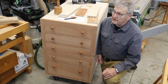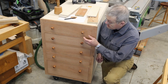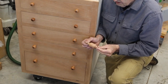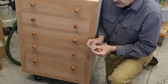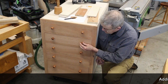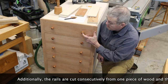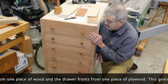Being a cabinet maker with a woodturning problem, I always try to put some turning in all of my furniture. In this piece I hand-turned the Shaker style knobs. I turn these as a joined pair like this, and then cut them in two after I've turned all of the details. Then I put them in a chuck and turn the other half and put the black dot in. This gives me a perfect grain match between the two knobs when I turn them around and put them in my cabinet. A trademark of mine is to put a contrasting dot in all of my furniture pulls, so these all have dots in them.